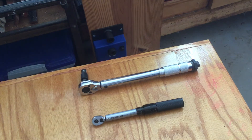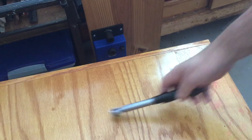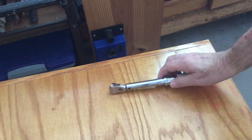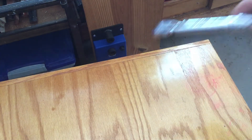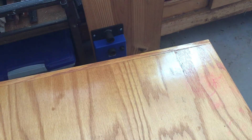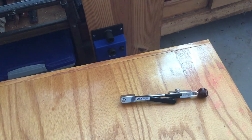Let me get the next two — these two are ringers. First up is the Icon: 3/8 head, $105, 40 to 200 inch-pounds, plus or minus 4% accuracy. Very nice fit and finish, although indoors I have trouble reading the numbers. Under a light or outside in natural light I can read them. Finally, direct from Australia, a Warren and Brown deflecting beam torque wrench — quarter-inch anvil, 10 to 220 inch-pounds, plus or minus 2%. So let's get it set up and try them out.